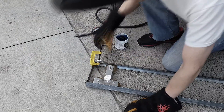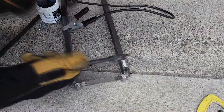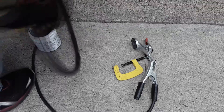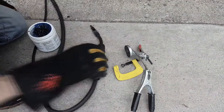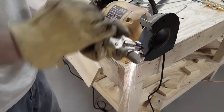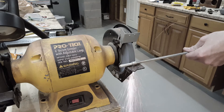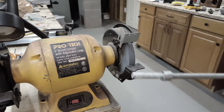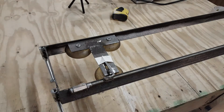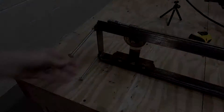Now that I have the slider part done I can start welding up the couplings and the bushings for the legs and the threaded rod. I will need to weld four couplings for the legs and two bushings for the threaded rod to go through. I will also weld the allen wrench onto a 5/16 inch coupling. Now I'm going to grind the allen wrench piece smooth as well as the two nuts that I screwed onto the threaded rod. I insert the rod into the bushings and tape the allen wrench to the slider, then screw in 6 inch bolts for the legs.